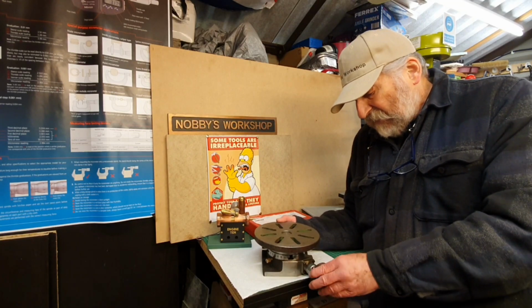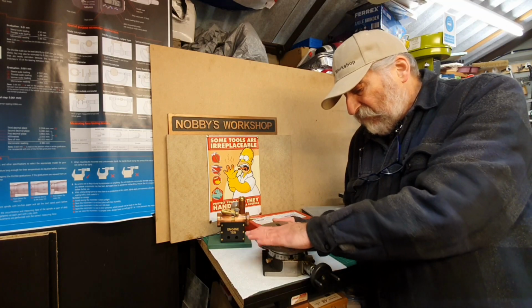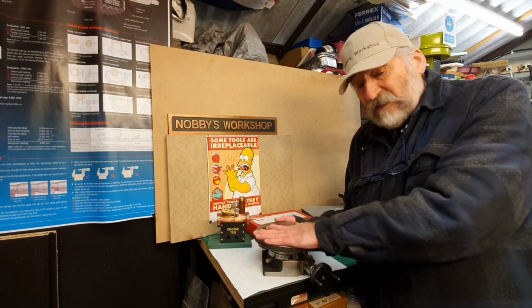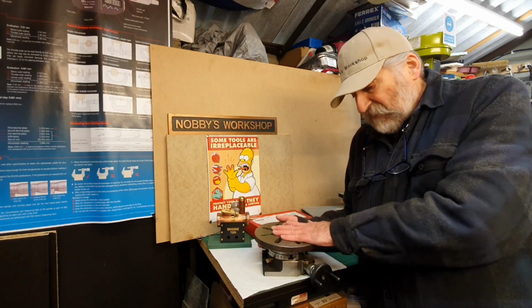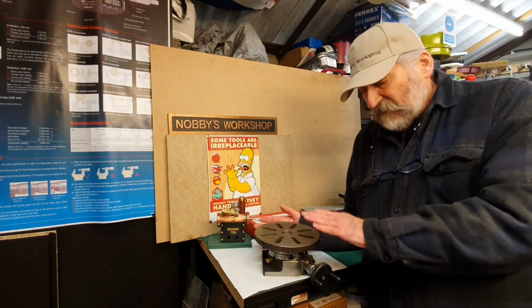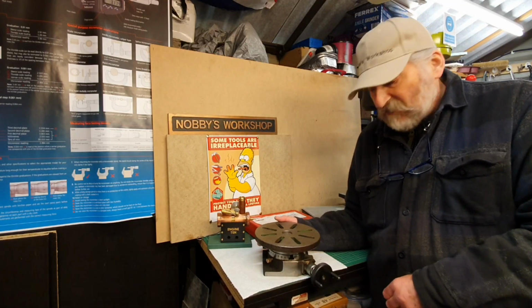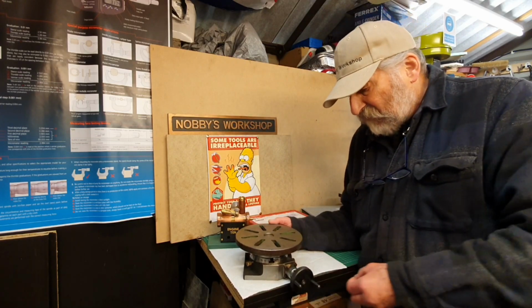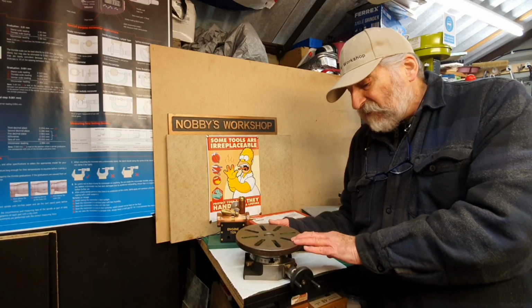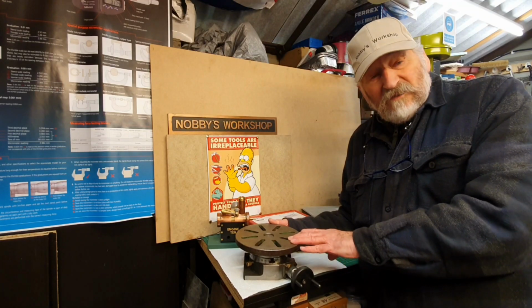And in the end, by not fitting the milling vise in the centre of the bed of the mill, I can put this usually alongside it so that I don't have to keep taking the vise off the mill, which is always annoying because it's got to be re-trammed in again. I've also used this in the past to drill bolt hole patterns